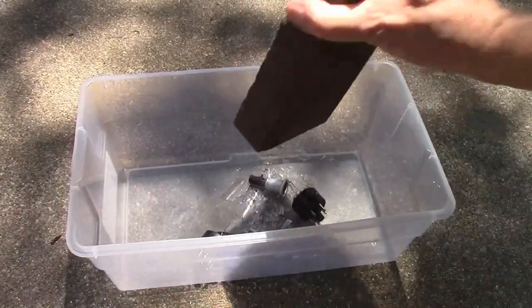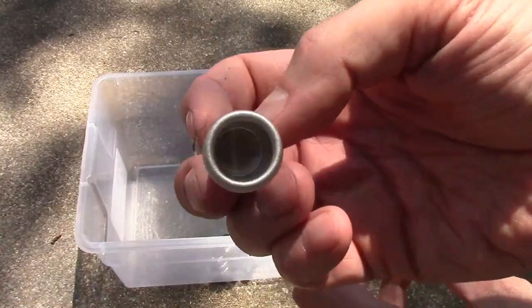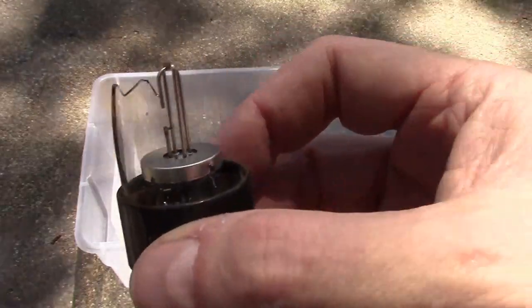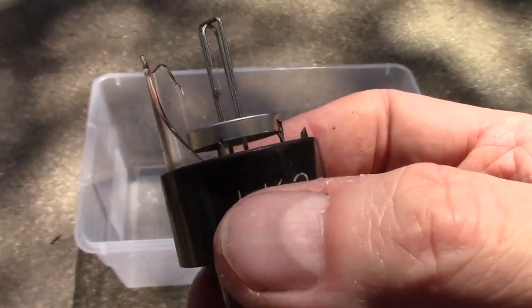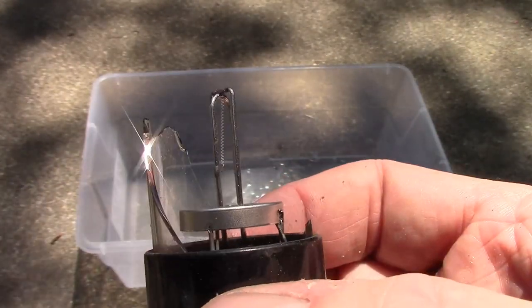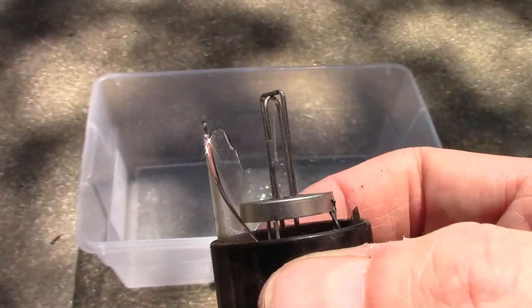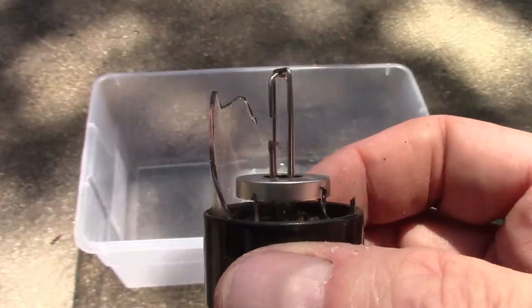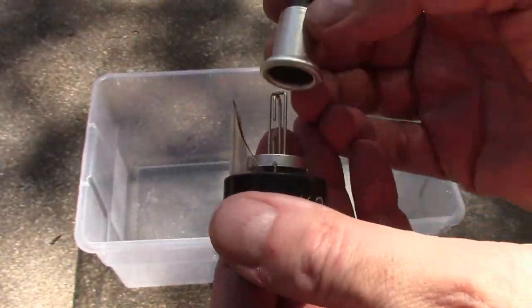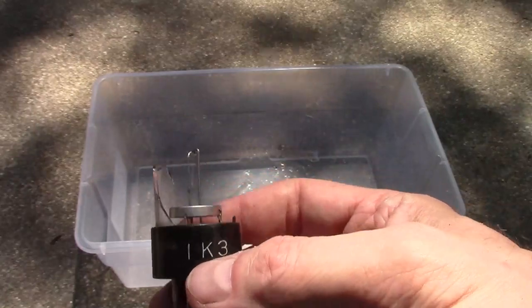The top thimble is the same. But as far as this structure — oh yeah, there's like a safety cage around the filament. So the filament is suspended in the middle, and then on three sides there is a continuous metal bar. And this one has a bit of a gap for some reason. So it's going to one end of the filament — it can't short into the others. So there you have it. Since none of the data books talk about this and you can't see it when the anode is on, it took breaking a couple of tubes open to finally find out what the difference is between these two.